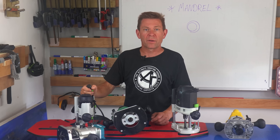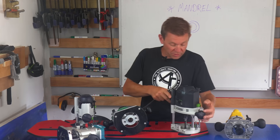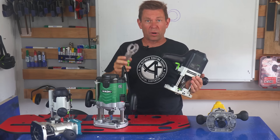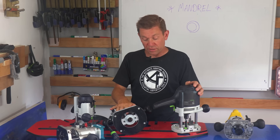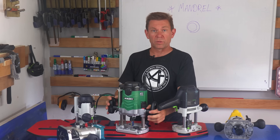If you can fit it on, use it, but I've found with some of these it doesn't actually work that well. My Festool router doesn't suck an awful lot of dust out because it's quite open - it just seems to go everywhere. With this one you've got a nice preformed casing that comes around. The Festool dust extraction clips in so nicely and you can still see what you're doing - it gets out the way. But this is £600 and that's £150, so there is a lot of difference. Sometimes with a worktop jig you just want a nice heavy router with a bit of grunt, then vacuum up afterwards.